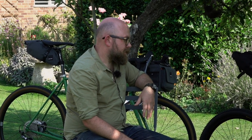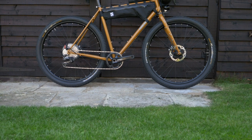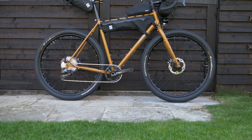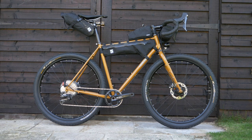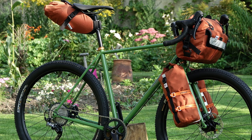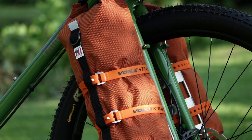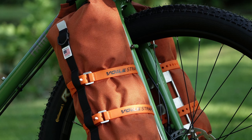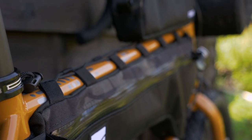Because of the design of this bike and the sort of riding it's intended for, we've used wall thicknesses of 0.8/0.5/0.8 for the top tube. The down tube is the same but has a section of 1mm internal at the head tube — it's called DZB, an internal gusset. At that wall thickness on this style of bike, 631 is perfectly strong enough. We've also added a small external gusset because if people are loading the fork with big panniers for a world tour or a few weeks away, it gives extra strength in the highest-loaded area of the frame.